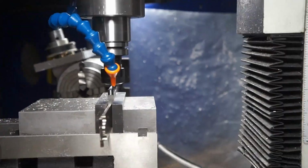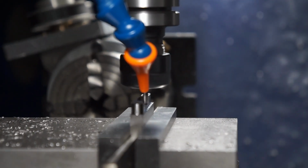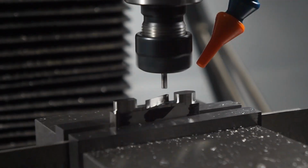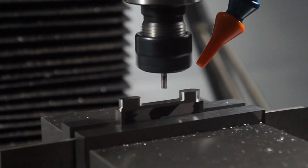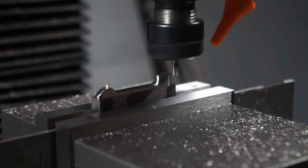Full depth of cut roughing. Titanium likes a nice heavy chip because you want to get rid of the heat in the chip, so I take about as aggressive a cut as I can with this little mill without going too crazy with my deflection. I could probably hit it a little heavier, but this is dependable and I can kind of walk away from it. Air blast seems to work nice. I'm happy with it.